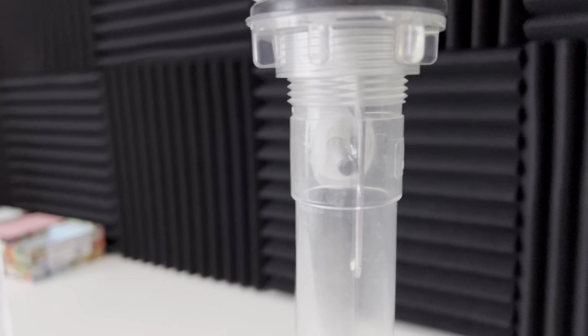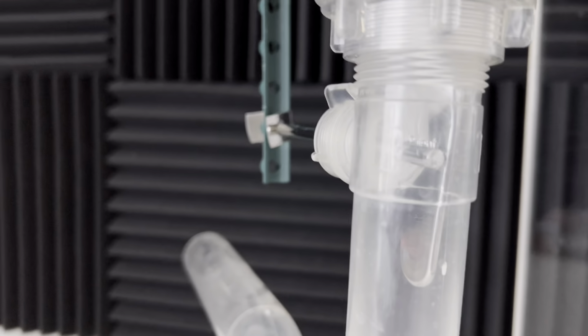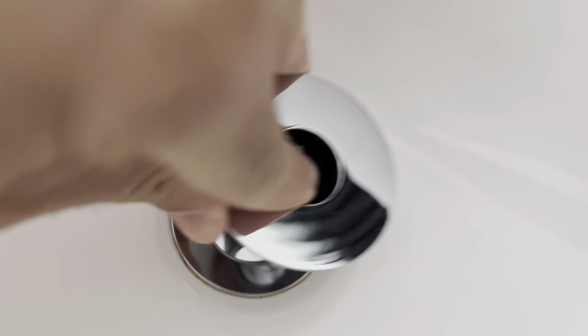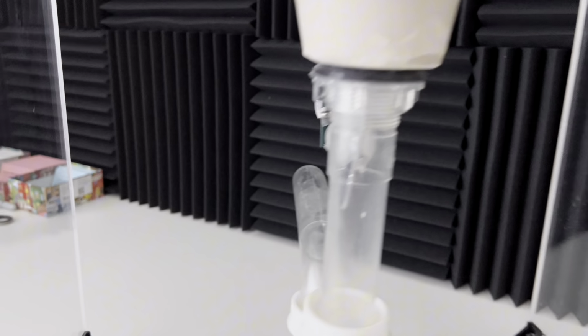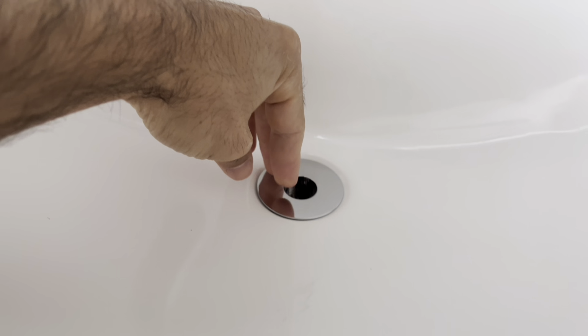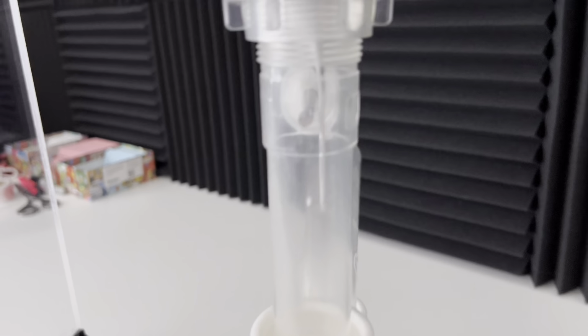Again, the importance of having that pivot rod centered in the drain allows us to easily see if we've installed the sink funnel correctly. If the sink funnel sits flush in the drain, then you've done it right. If it sits skewed, then we're actually sending the hair onto the pivot rod and you'll get a clog. This is the exact opposite of what we're trying to do. We're trying to divert the hair past the pivot rod in the drain, as you can see here.